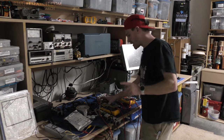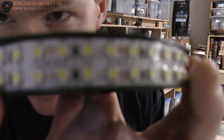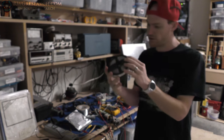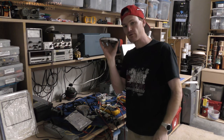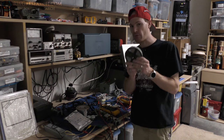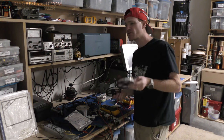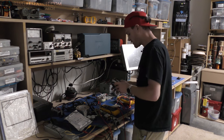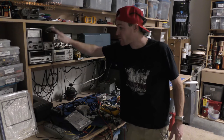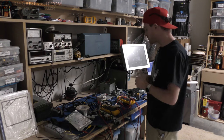You don't need a current-limiting LED driver because these strips have resistors built in. You can cut them every inch — each group of four LEDs has its own two resistors, so all I have to do is regulate the voltage and the current is taken care of. Each roll is 6 amps, so I need a total of 12 amps of DC current. We need to be able to voltage-control the under-cabinet lights for dimming and power some others elsewhere.